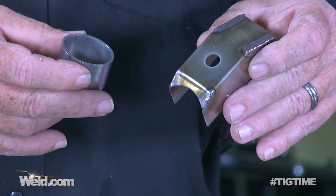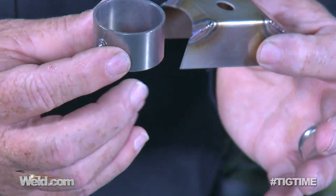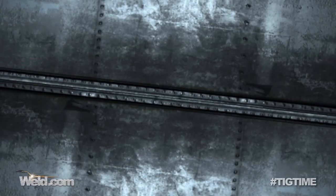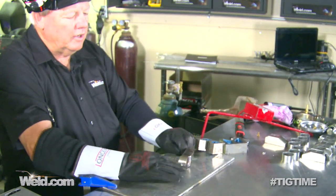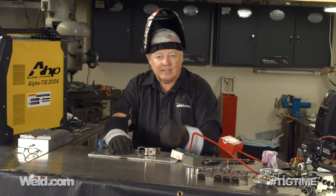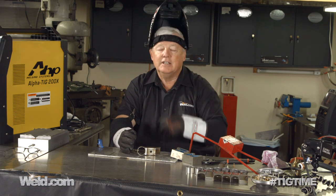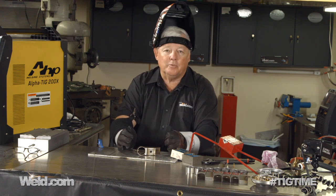Here's the shell — it's finished welded, or nearly finished welded. We're getting ready to put the second piece in place. Once we do that, we'll tack it, weld it complete, and then polish part of it. This is really phase one. We're going to let this cool off and then polish it. There are going to be two different types of polishing — phase one polishing, and then we'll put special screens in and do a final polish.